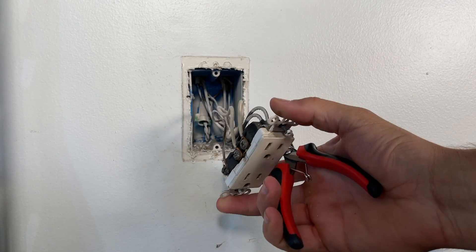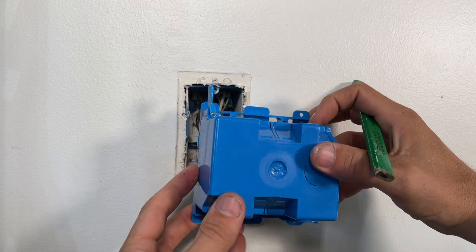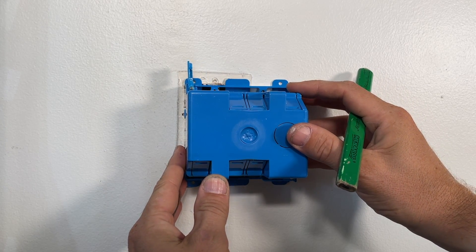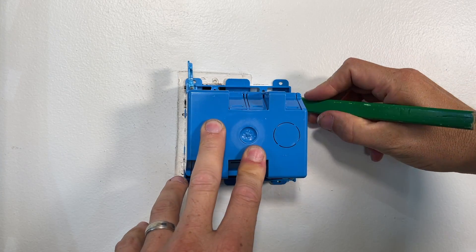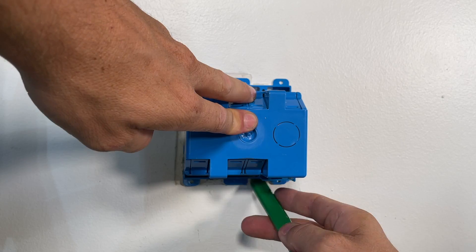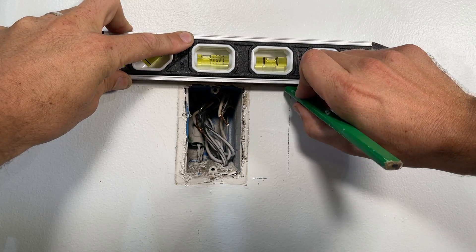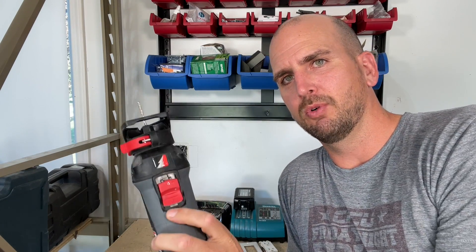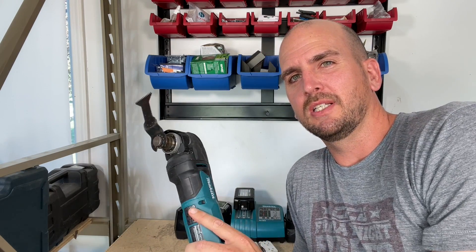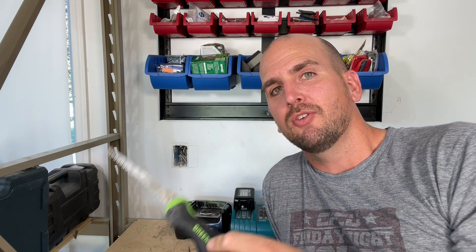Since I have plenty of wire here, I'm going to cut these off with my micro side cutters and start fresh. I'll line up one of the corners so it's already cut correctly — this side lines up to the stud and we'll cut in this direction. I use a torpedo level to make sure everything is cut level. To enlarge this hole, I'd prefer either a Rotozip or an oscillating tool, but you can also use a simple jab saw, which costs five to ten dollars.